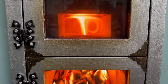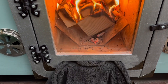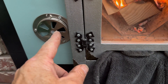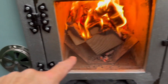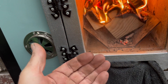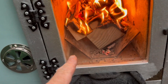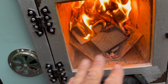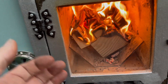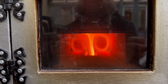We're now close to 20 minutes since I lit the fire. I've got the rag stuffing those holes, so air is going through the two side vents, taking it behind the stove and running back underneath the sloping glass — in theory getting preheated. I don't think it gets seriously preheated until the fire burns right down and the ashes are lying on the glass, but it's all about experimenting.